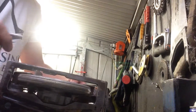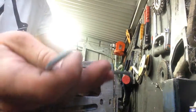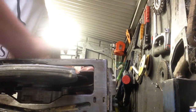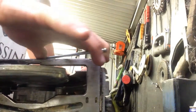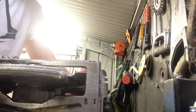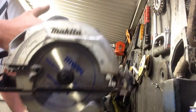To crank down on it, you must again press this black lever down, grab your allen key, and in a clockwise motion, for this saw, tighten down that nut. It doesn't need to be superhuman tight — you won't be able to get it off again. And that's how you change it.